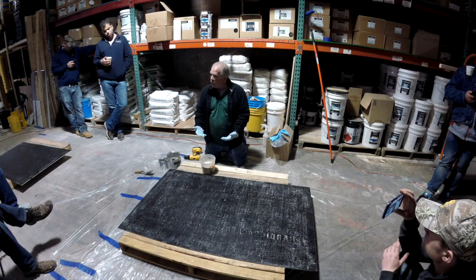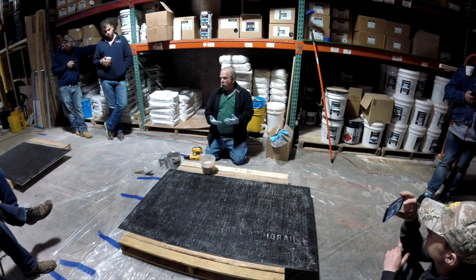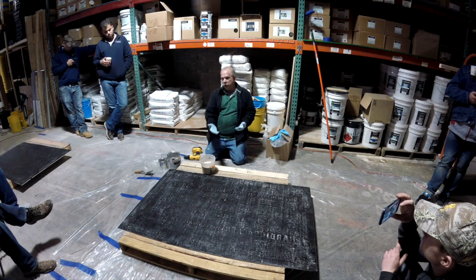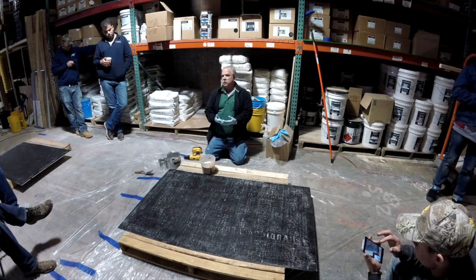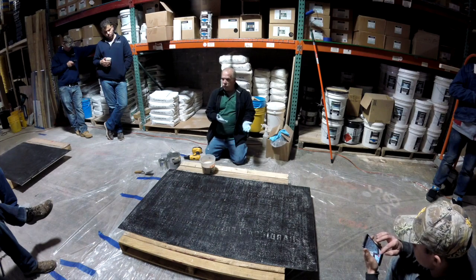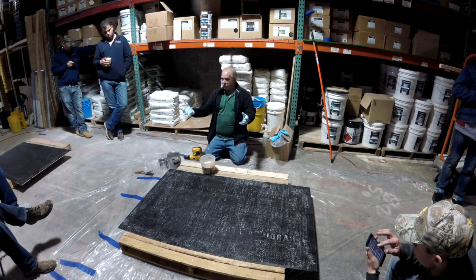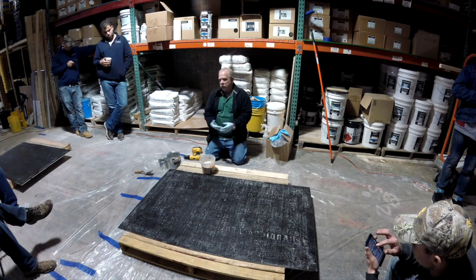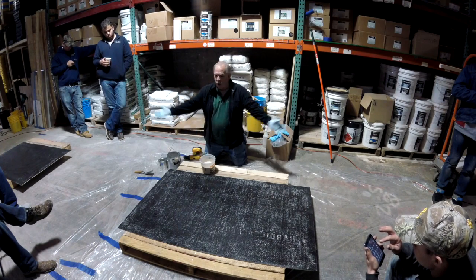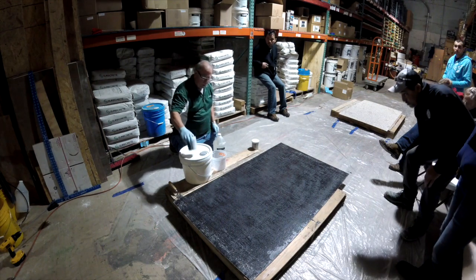so you're not having them all bunched together. Now the water base isn't going to hit as fast or as strong as the solvent base does. That's going to go off even faster if you left it in the bucket. In fact, the solvent-based epoxy, if you mixed it in a gallon can and you walked away from it, 15 to 20 minutes later, you're going to come back and that can's going to be smoking, literally. It gets that hot. So it's exothermic, it just releases its energy. That's why you want to get it out and spread, and then you got more time to work with it. So this is where you put the metallics in.